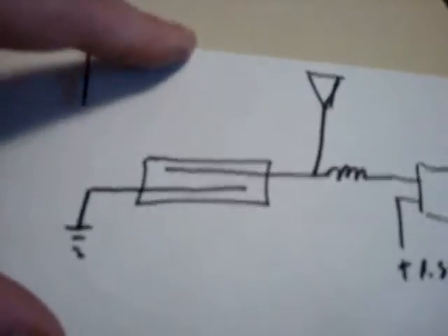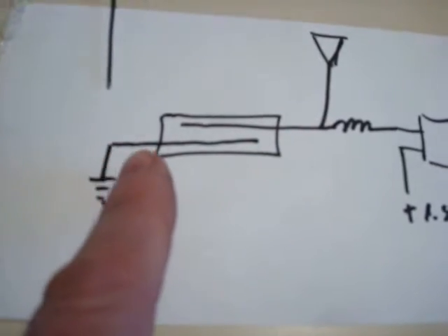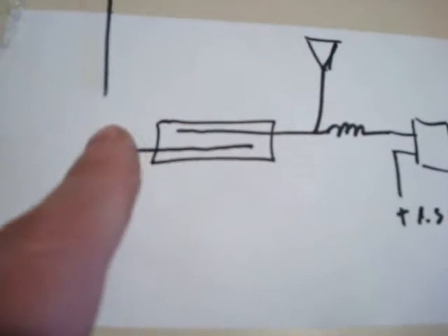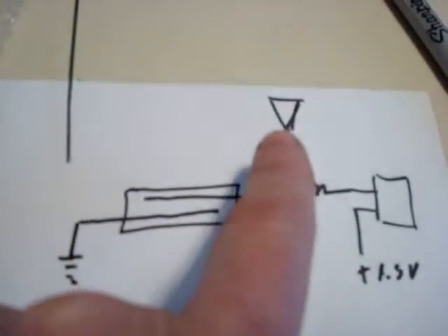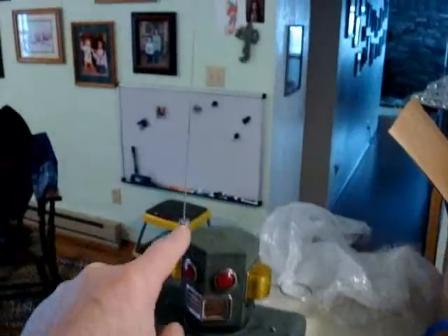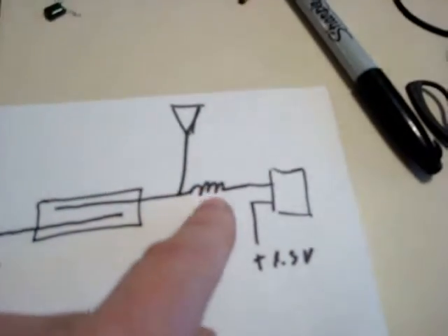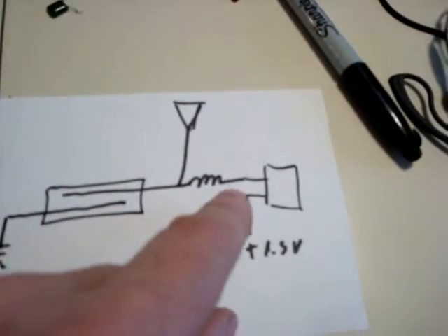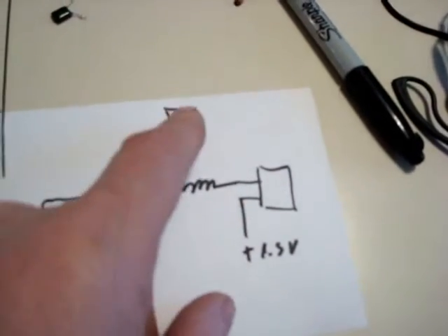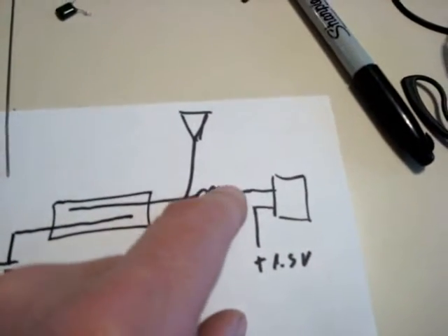What triggers the meter is a device called a coherer tube. Inside there's a small glass tube that has two wires that run the full length of the tube. One of the wires will end up going to ground in the robot. The other wire goes up to the antenna, which is critical — if you don't have this antenna for your robot it won't work right. And then there's a choke to block the RF signal from being shunted, because high frequencies won't pass through the choke.